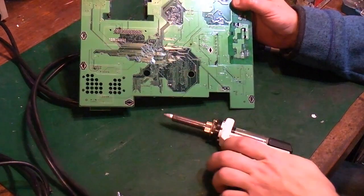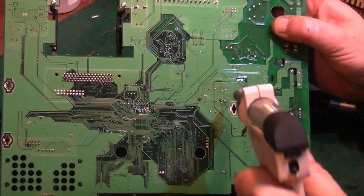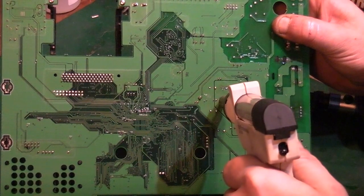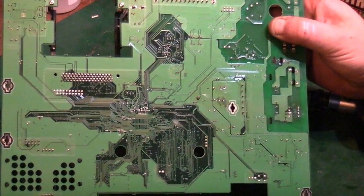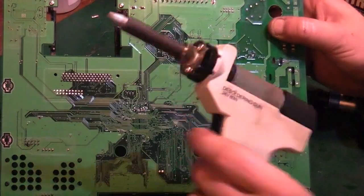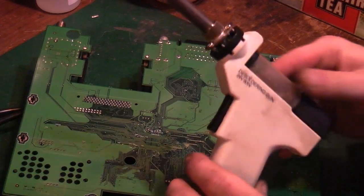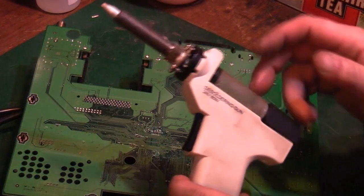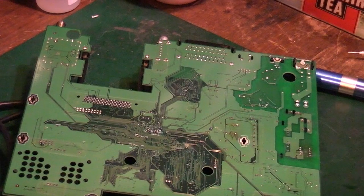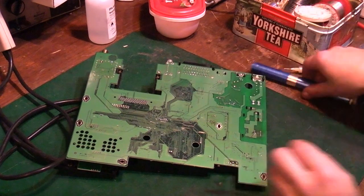Let me see if I can get you up a little bit so you can see. I'll zoom you in a little bit. Ooh, there we go. This is where we're working. Just hold it on a second. There we go, that one's clear. And that one's clear. It's that much quicker using something like this, and this is not an expensive one. This desoldering station was like £70 or something like that. In fact, I think I've got an unboxing of this on my channel from when I first got it. But it's definitely worth the investment if you're going to be messing about with a fair amount of this type of stuff, because it makes getting components on and off the board a lot easier than using one of these.